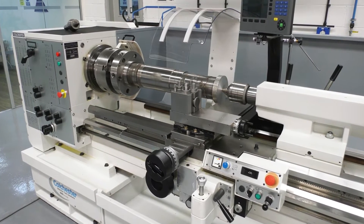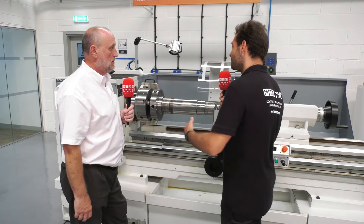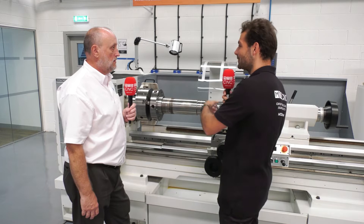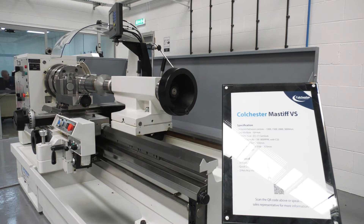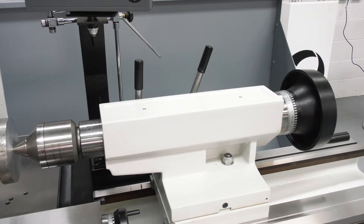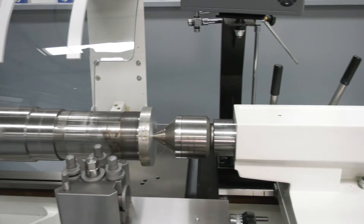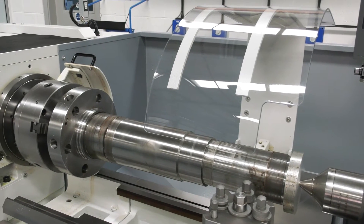Anything that will fit on the lathe. If you're making big parts like this, it'll be a long, slow job, and you want to take chunky cuts to try and speed that up. How do they know they can take chunky cuts with this machine? It's a good rigid machine — a very wide spread on the bedways, a nice heavy duty headstock, good rigid spindles. We can take anything from very light finishing cuts to nice heavy roughing cuts.